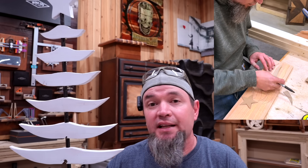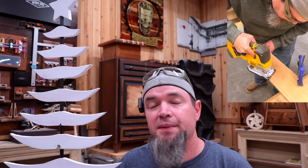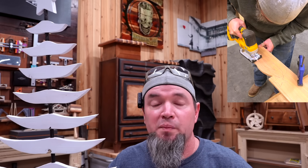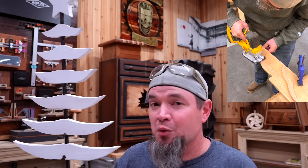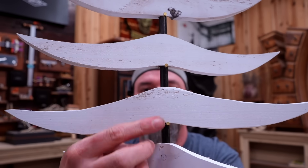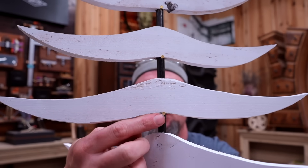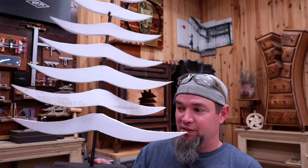Making your templates is as simple as that, and they don't have to look exactly like these — the most important thing is their length. That's why you need to draw out that tree shape: you want these to actually look like a tree when put together. Once I had the limb templates done, I laid them out on my fence picket and traced them. I also drew the little star at the top directly onto the fence picket. Then I used a jigsaw with a scroll blade and cut out all the pieces. With all parts cut, I lined them up, drew a line down the center, and drilled a three-eighths hole in the center of each one. I put all pieces on, measured one inch between each limb from the back, and installed a brass tack — this allows it to slide up and twist.